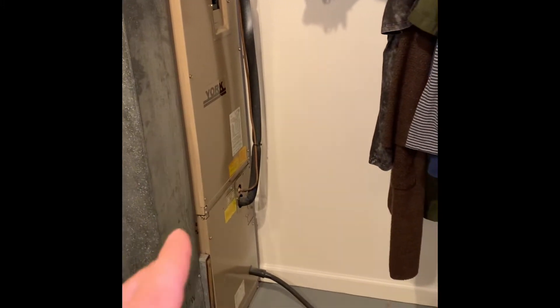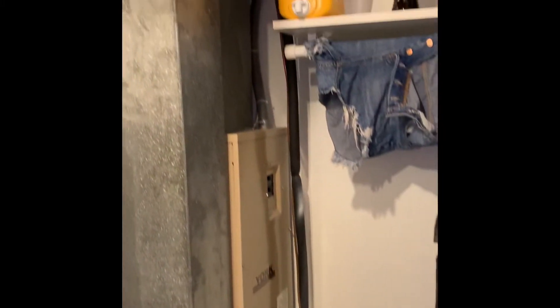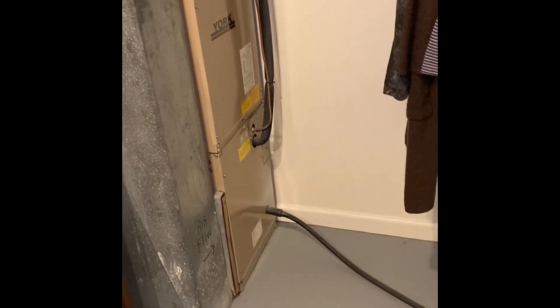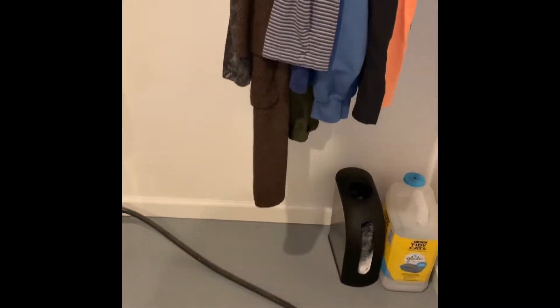For the new return drop, filter-wise we're probably going to do a bottom-mount box filter on the air handler. Whether they're going to do a media filter or just a one-inch filter depends on the available space. The drain is here and we're going to do a Honeywell thermostat.